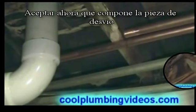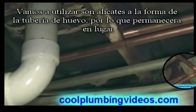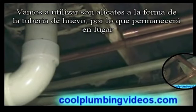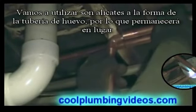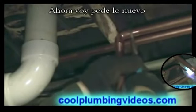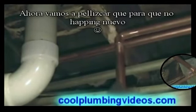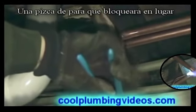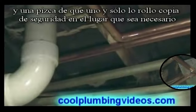Okay, now we've made the offset piece up. Since it is in a spot where it's kind of hard to brace, we're going to go back to using our channel lock pliers to egg shape it again. So stay in place. Wipe that excess flux off. Now we're going to pinch it again. And we're going to pinch that so that doesn't happen again. Pinch, kind of turn a little bit so they lock in place. And we'll pinch that one. And we'll just kind of roll it right up to the spot where we need it. Right there.